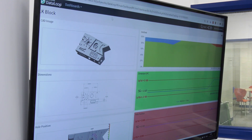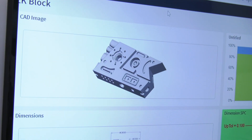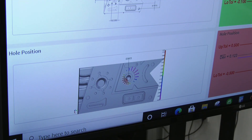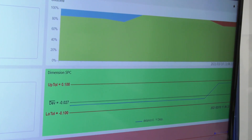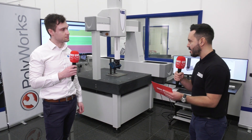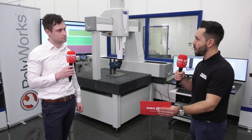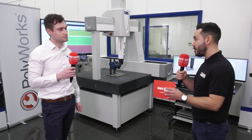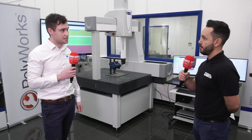Data Loop is going to monitor your process. If you have batch parts, you can see the trends in hole positions, dimensions, or whatever you want to keep track of, and you can monitor to make sure your features aren't getting worse — so that you can stop, evaluate what's going on, and stop before you start making scrap. You could be monitoring your tool wear and again stopping it before scrap is made. So with this data you can monitor if a part is going out of mid-tolerance and send that information to production for them to make alterations to get parts back into mid-tolerance and keep a stable process.